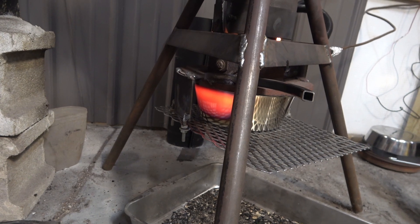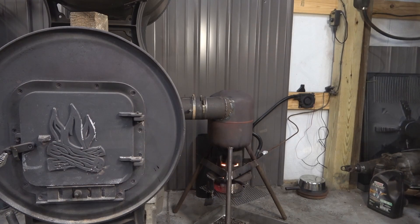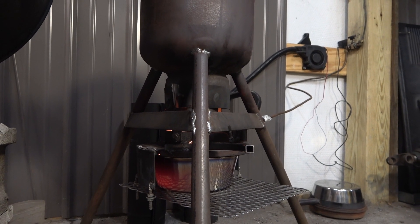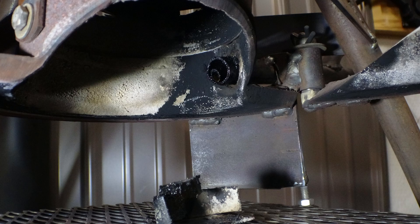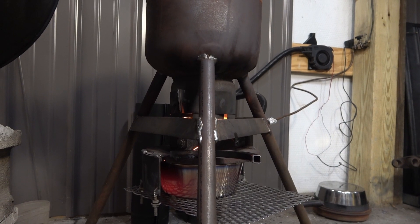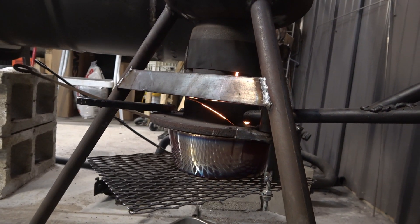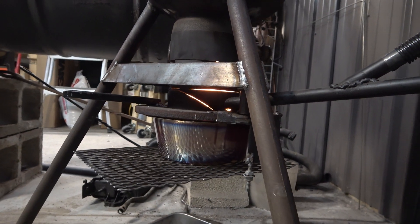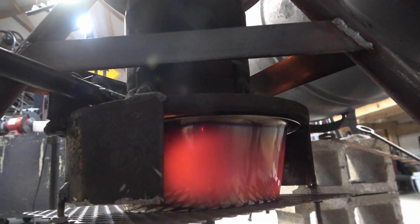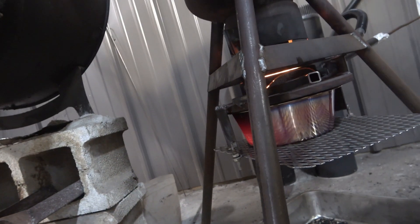My concern is that within seconds that pan is glowing — it may not last very long. What happened was this side of the pan was glowing bright red because of the air blowing out of the air tube. I shut it down and put my air diffuser back on the end of that tube, so now the air is not blasting straight at the side of the pan. The pan is not glowing bright red anymore. The front is a little reddish but not bright red, and the back has a fair amount of red, but the diffuser knocks the air down and around the pan, keeping it from having such a bad hot spot.